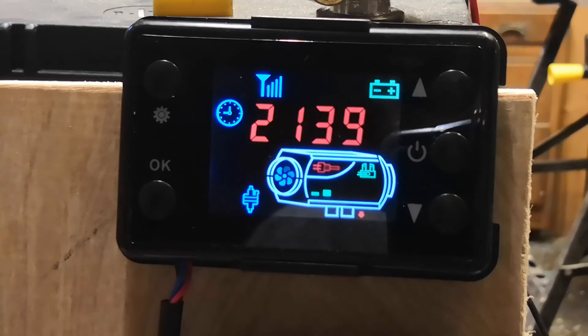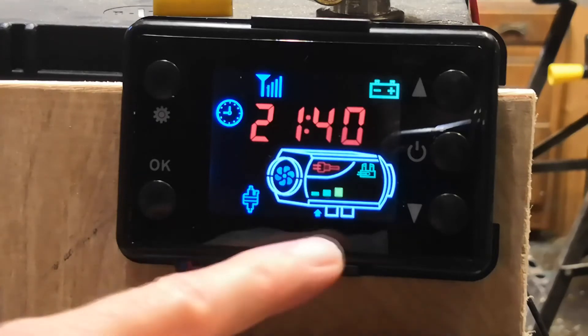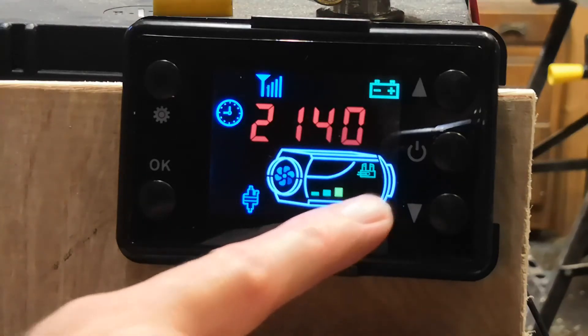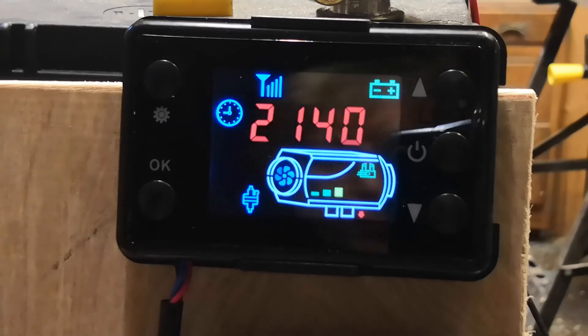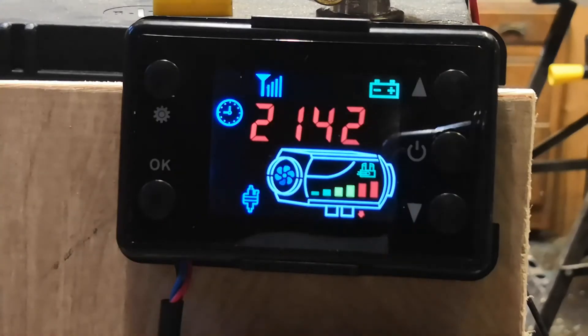You might have heard a little bit of a roar — looks like the flame tube is firing up and the pump is speeding up as well. I've got my hand in front of the heater and it's coming out with hot air now. Things are getting faster, and as the body of the machine gets warmer you'll see those bars go up on the display — up and up as things get hotter. We're firing up now, well underway. All bars going — that heat exchanger is nice and hot. I can feel that heat blasting out. We should be up to temperature pretty soon.